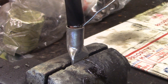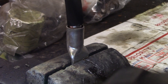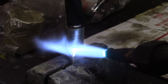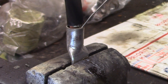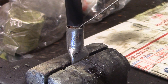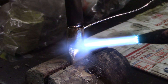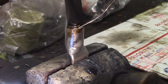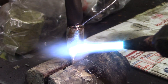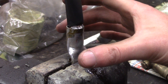I pull the flame away and just feed solder in because there's a lot of residual heat. Unwrap some more solder, and if it gets a little cold put some more heat in - just enough to make it flow. This is oddly satisfying. This is a bad time to remember you forgot to slide the shrink tube on first - goddammit. But you can see solder up top there, so it's all filled up. Let it sit; don't mess with it while it cools off, then we'll clean it up and shrink tube it.